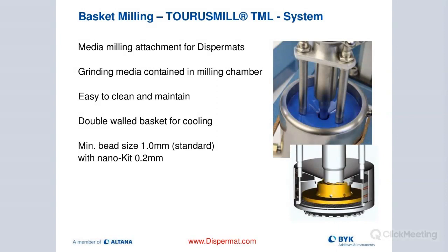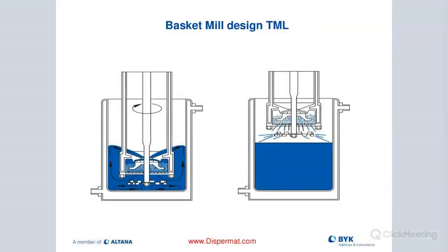The basket mill is also double-walled with cooling channels, allowing me to properly cool it and maintain the temperature needed so it doesn't overheat. Cleaning is much easier than a horizontal bead mill — once I remove my slurry, I fill the container with cleaning solvent, submerge the mill, and run it for a few minutes. Depending on the material, sometimes three or four cycles are needed, but it does a good job. There are no bearings and no seals, so it's a very easy, well-designed, and user-friendly system.